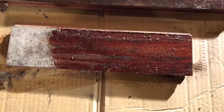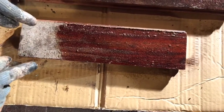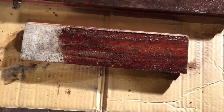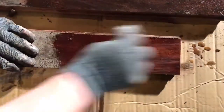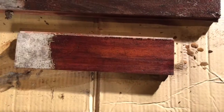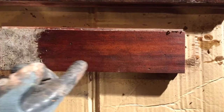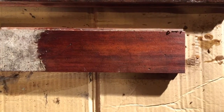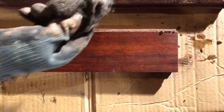Okay. So, I've got my steel wool. You saw earlier, I put the stripper onto the glued part, off that came, I put some more stripper on. I wouldn't normally need to leave it this long, but we got called away by the other bit of floor, just like a telephone could be, or a neighbour coming along to say hi. So it doesn't matter, the stripper is virtually pH neutral, and what that means for you is that it's not going to bleach your timber. So that's now part two on the guide, which is where we put the stripper on, give it a little bit of time, and then give it a scrub. Now, same here.